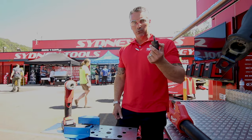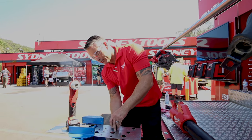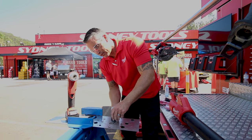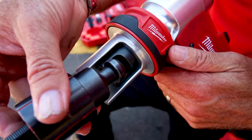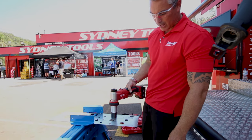So we've got a 12mm draw stud, so it's just a simple case of drilling a 13mm pilot hole through your material. The draw stud goes straight through and you screw the punch on finger tight from underneath. It curls over the connection here, then turn your collar.